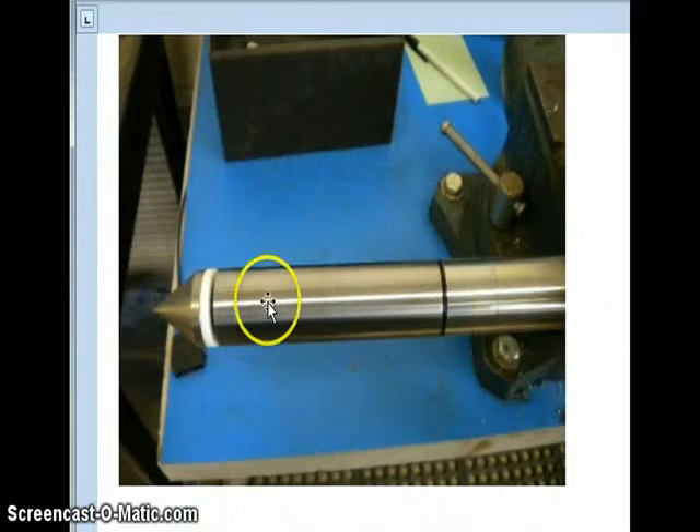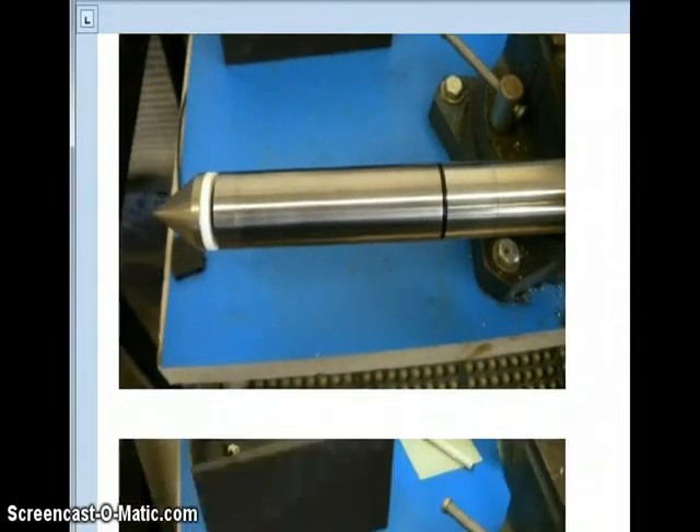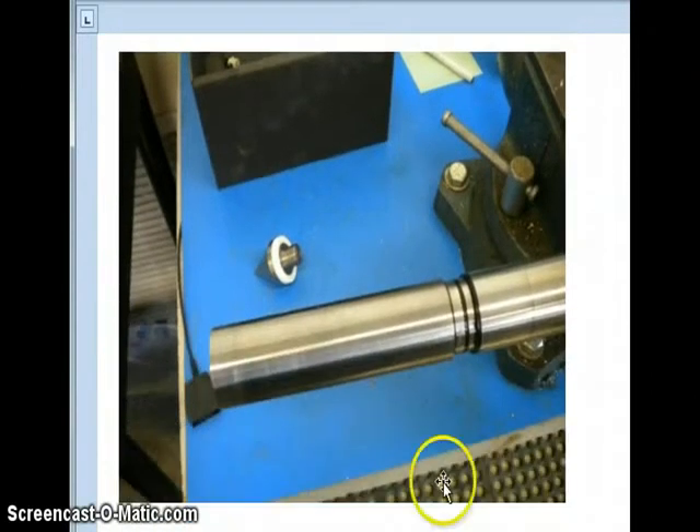Holding the cone secure, you can unscrew the tip — that would be this here — and the pore pressure element. Unscrew the tip and pull the sleeve off. Here's the sleeve coming part way off. There's the tip and the pore pressure element. And here's the O-ring that is visible on the surface and a couple of O-rings underneath on the sleeve area.